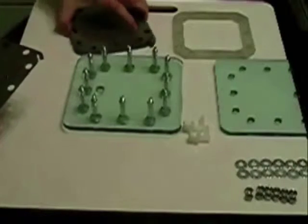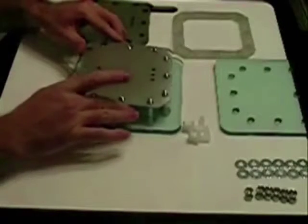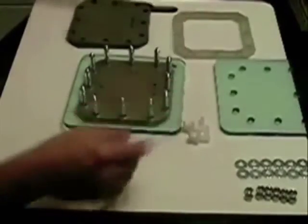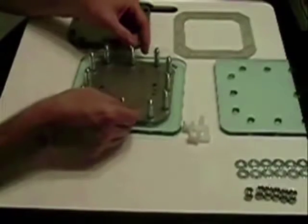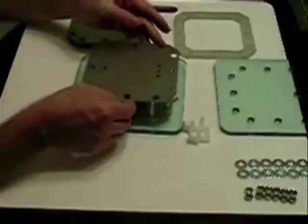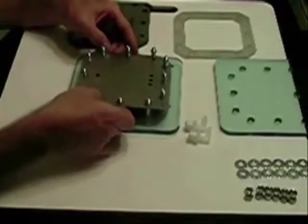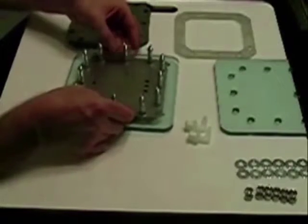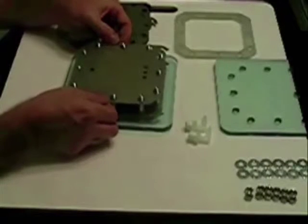You want to turn the plates — you normally wear gloves but make sure you've got clean hands. Put your first one in place. Here comes the fun part: getting it to drop. Once you do it, notice the tab — the connection is on this side. Come back with another gasket. These plates have already been cleaned, sanded, and cleaned again. Come back with a second plate, drop it down, go with another gasket, another plate, alternating every other plate.